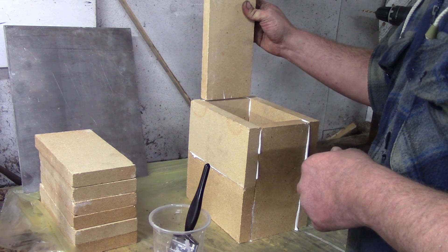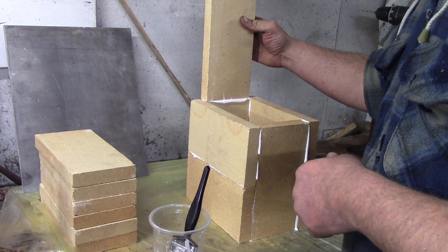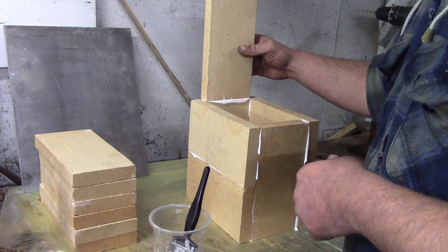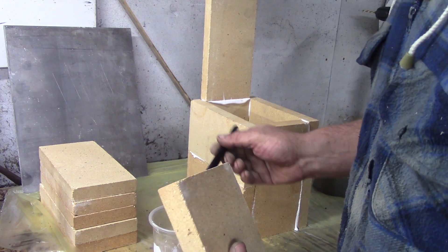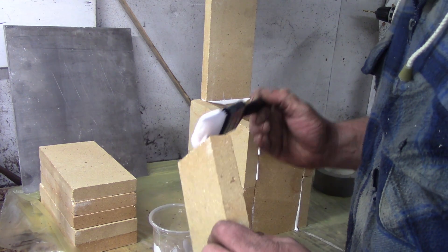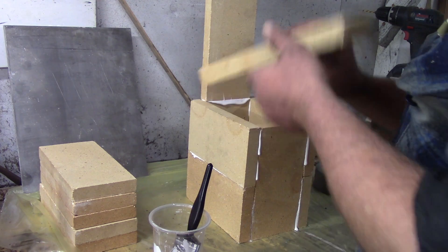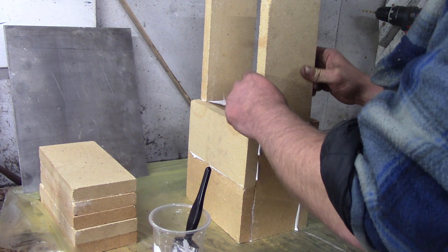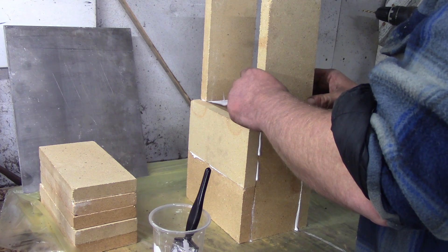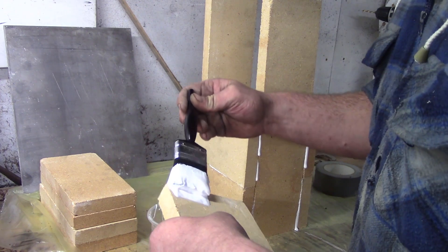Then I'm going to slip the steel jacket around all of this and pack it all with perlite, which is an expanded mineral with very good insulating properties. That perlite is going to be mixed with cement, so it's not going to come into direct contact with the bricks, which will make it last quite a long time. This is rated to around 1600 degrees C, which hopefully it will never reach. So we'll have fire brick on the inside, then perlite and cement, then the steel case on the outside.